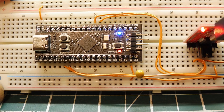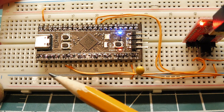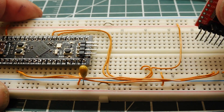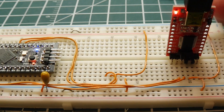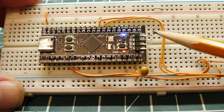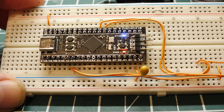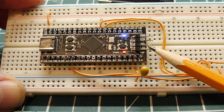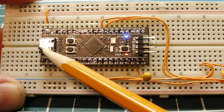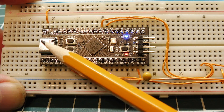To upload a hex file or binary file into the microcontroller we have three ways. First, we can use the flash loader which uses USART1 on GPIO pins PA9 and PA10 — just move the FTDI module over to upload via USART1. Second is SWD — serial wire debug — using an ST-Link dongle plugged into the SWD pins to upload a hex or bin file. Third is through the Type-C USB connector using DFUSE software, where we convert our hex or binary file into a DFU file and upload it through the USB port.